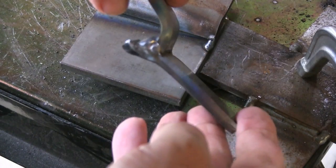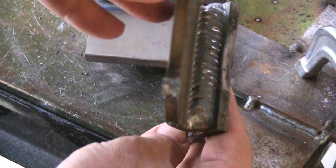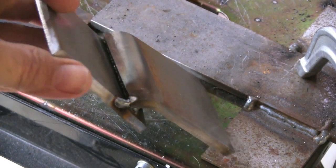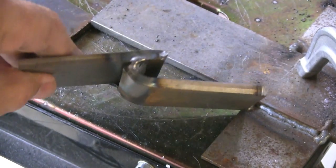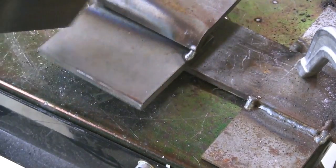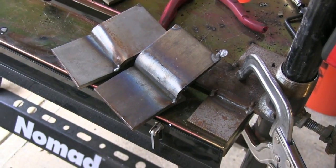Now, it would be slightly over welded for 1/4-inch, but it tells me that the parameters are pretty good, and it's going to hold up pretty good on that big thick chunk of steel on the forklift. Now that's the single pass weld right there. It actually passed. It bent over like that without even failing, but it started to give, started to open up a little bit, and so you can just see that the other one passed better on a fillet weld break test type situation.